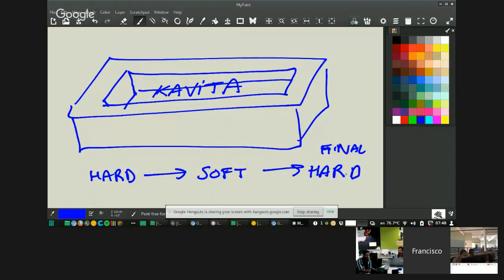A hard mold with hard plastic in letters will not work. So this thing that you have in your hand should be made of silicone because it needs to be soft. Then you need to create the hard counter model of this in wax. So you have to mill in wax like this, your letters going up inside a void. When you fill this with silicone, you will have the same thing that you have in your hand, but made of silicone and soft. And then in this soft material, you can pour liquid plastic, and when it's hard, you can bend the silicone and remove them.